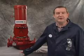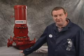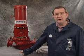The mechanical seal is the most critical service item in any pump. It's likely you'll do many of them in your time. Close attention to this video will allow for ease of installation of a replacement seal in the field while paying attention to your personal safety. The Armstrong 4300 split coupling pump design allows for the mechanical seal to be replaced without disturbing any of the major pump components or removing the motor.